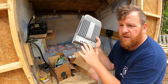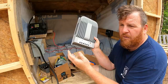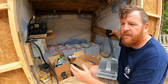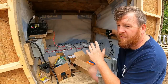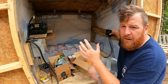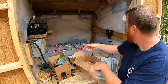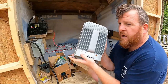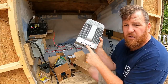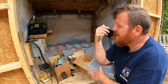That's not the case at all from what I understand now, after doing a little more research. We can pump up to 150 volts into this. So this is not only a charge controller, it's also a converter — it converts whatever voltage you pump in from the solar panels into a useful amount of power. Considering we're only going to use 500 watts on it, having a 5000-watt inverter is just ridiculous — it's just what I bought a couple years ago. We're going to use the new charge controller so I can be a little more versatile. I can use it with a 24-volt system, which will put lower amp draw through the wires so I can use a little bit smaller wires. It's a bad setup, so we're going to upgrade.